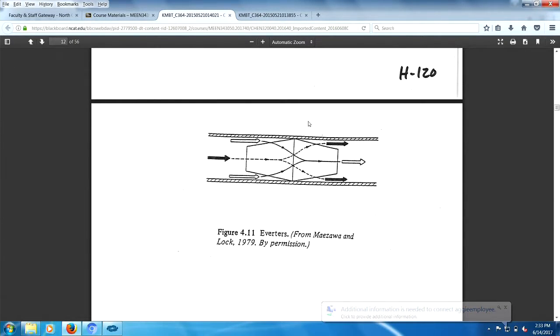A pressure drop requires you to pay a utility bill, right? Because the pressure drop times volumetric flow rate is power, and we're going to pay a power bill on our heat exchanger. But what it does, it knocks heat transfer and everything you learned about heat transfer right in the teeth here.